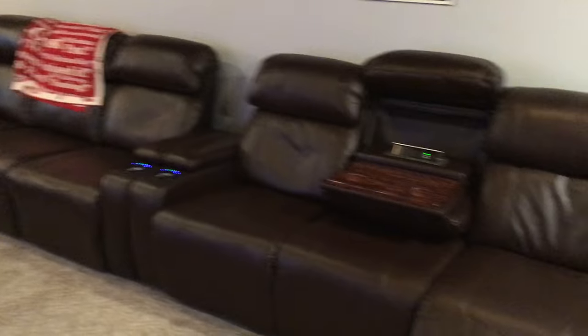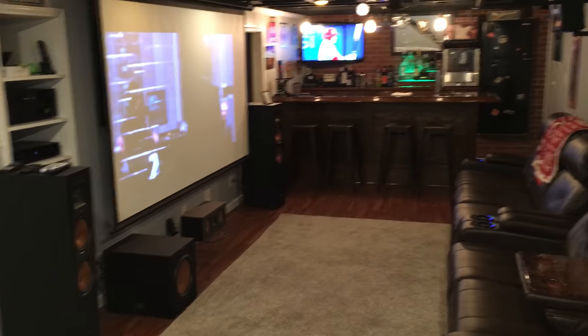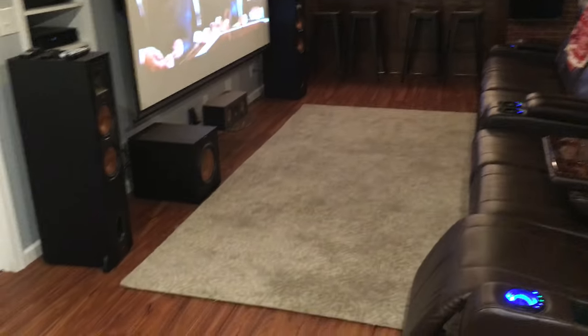Let me start out by telling you about the floor. I put in vinyl plank flooring. I wanted to go with vinyl in the basement because the other options — laminate and rug — don't do well when there's water. Eventually your hot water tank's going to go, sewer backup or whatever. The vinyl plank is snapped together, no glue, no underlayment. Got it at Lowe's, about $3 a square foot. Looks nice, looks like wood.